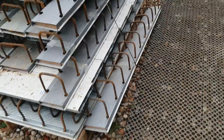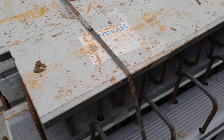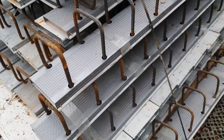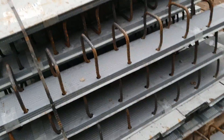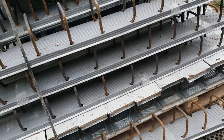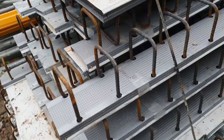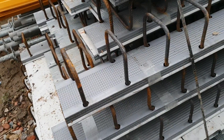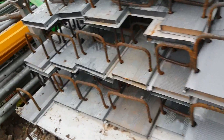Just to show you - this is the quickstrip continuity strip. This one is called a conti bar - it's 12mm bars and that's the connection from the slip form to the slabs. That's how it looks when the slip form is going up. Once the walls are poured, this is used in many situations when you want to close your shutter and then later continue your element - walls, slabs, and so on.